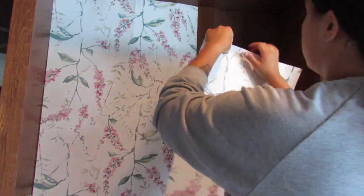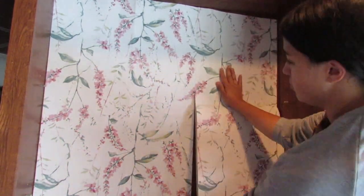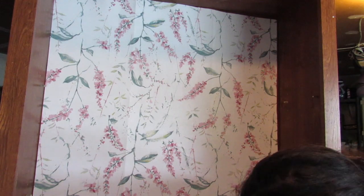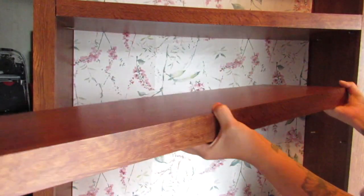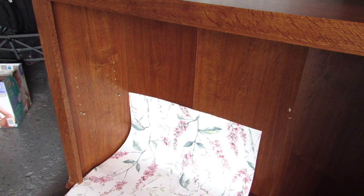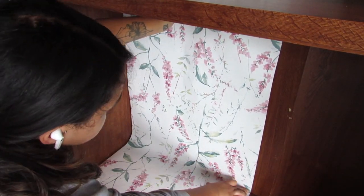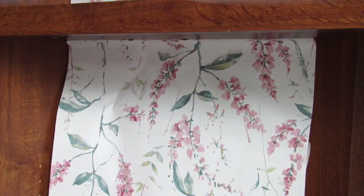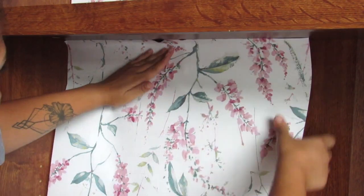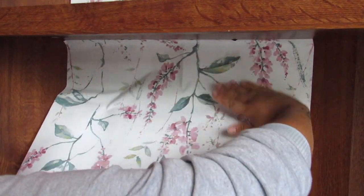I had a little bit of difficulty cutting it perfectly, but the biggest thing with peel and stick wallpaper is you want the design to line up, as you can see here. That's really what I focused on — trying to cut it as evenly as possible. For the bottom I put the shelves back in, and what I did differently was I over-measured a bit so that when I applied the wallpaper I was able to go in with my box cutter and cut off the excess, giving me a more straight and even line to the backing of the bookcase.